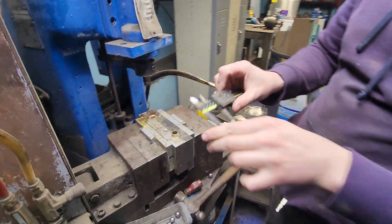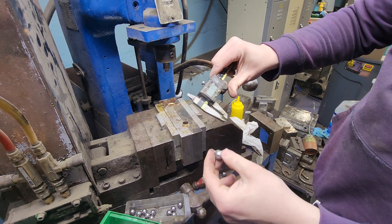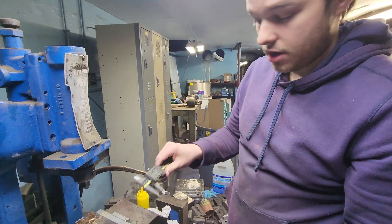The calipers that live at the ball-out area have stuff all over them, so we're about 10 thousandths at zero with the crud on them — so it should read 570 when it's 562. That's good.